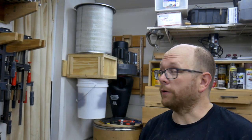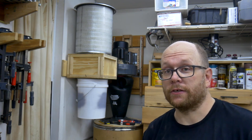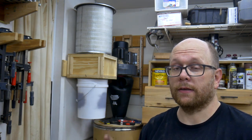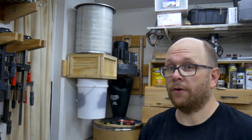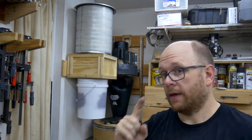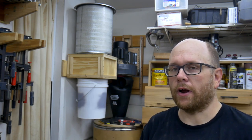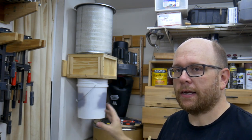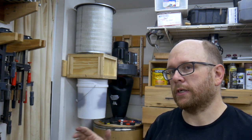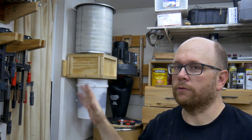Well, let's just say that one wasn't without its challenges. I used the anemometer quickly on the inlet and it's looking like I don't have very much of a drop after putting this filter on. I actually saw more of a suction drop by adding the cyclone — so from no cyclone to cyclone, there was a larger drop than from cyclone to discharge filter.